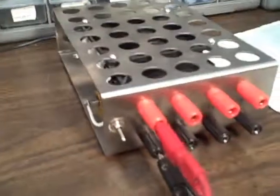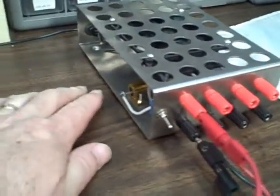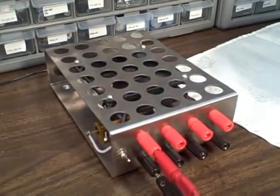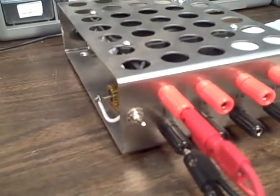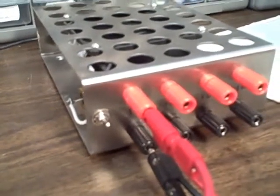Right now I have it connected to a little load center. Inside the load center, we're connected on the 1-ohm terminal — it's a precision 0.1%, 1-ohm resistor, 50 watts. We have a fan-cooled unit. I've got my DC voltmeter connected in parallel to that 1-ohm resistor so we can read the voltage across it. So you read the voltage across 1 ohm — essentially you're reading the current digitally. 1 volt on 1 ohm is 1 amp, 10 volts would be 10 amps, 12 volts would be 12 amps, and so on. So we're going to see what this thing is capable of doing by reading the voltage on that resistor. Let's go ahead and turn it on — we're going to start in the 12-volt range.